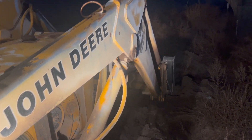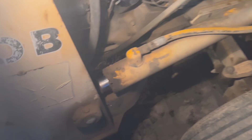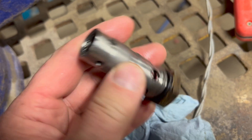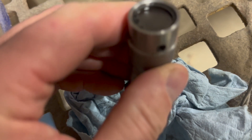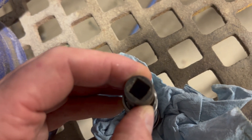It's going to be a chore — I've got to take this cover off and get down in there to get to that relief valve. Okay guys, here's the relief valve, and this little disc right here — I don't know how well you guys will be able to see it — is loose. It's not pushed up against the snap ring. What I'm going to do is use a socket that'll fit right inside of that, then put it in the vise and try to cycle that check valve to see what it does.